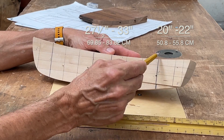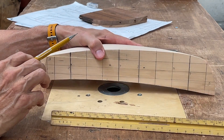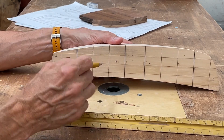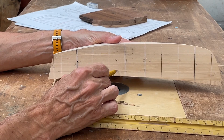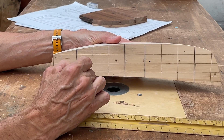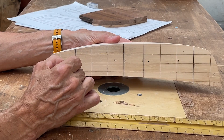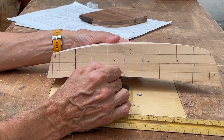Now why is that critical? Well, if you picture this upside down on top of the cabin roof, there is a hatchway, and that hatchway has to fit up inside of this empty space in the boat. So it's very critical — the distance between here and here, and here and here.